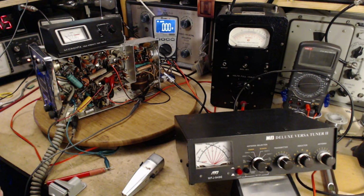I'm after the current. So the current, I equals E divided by R. E is 2, R is 100. So if E were 20, R would be 1,000, 20 thousandths, 20 milliamps. Wow, it's right near the 22 milliamps. It's right there.